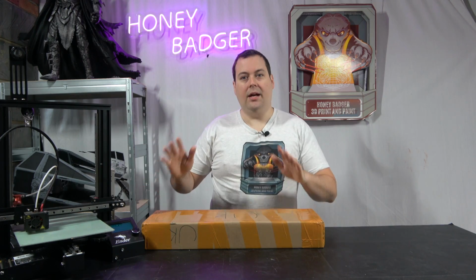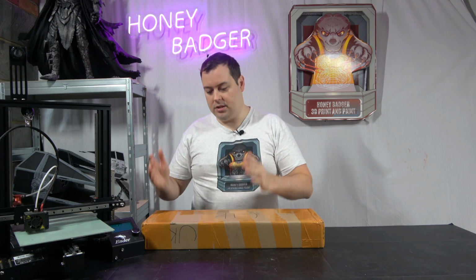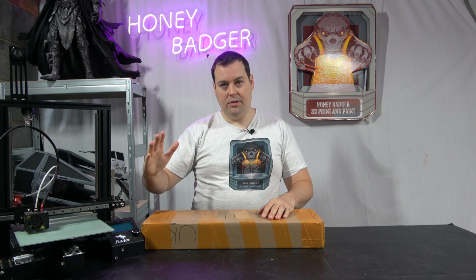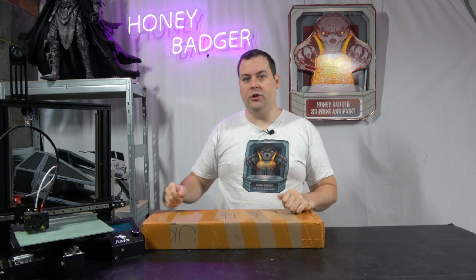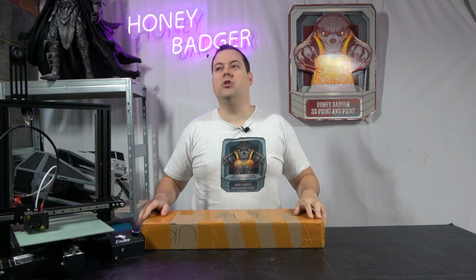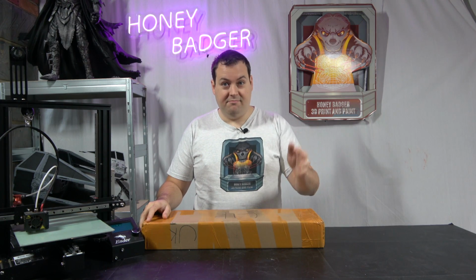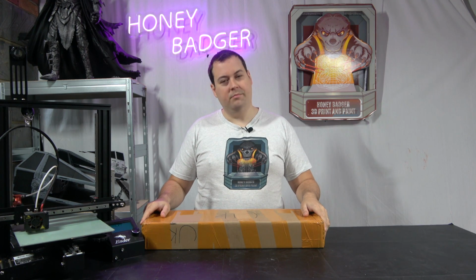The CR30, as many people know, is a belt-driven Infinite Z printer. The assumption being that it continuously moves the bed around on a treadmill so that you print at a 45-degree angle, and then you can print on your Z forever. You have to use a special version of Cura to get it to work properly, but you can print long pieces like a sword or a windmill blade, or a pool cue or a stick or a really long bit of filament. All of these things are possible and more. Probably not that much more.